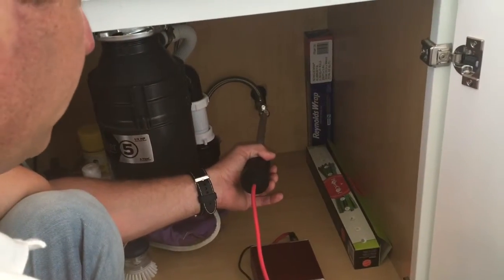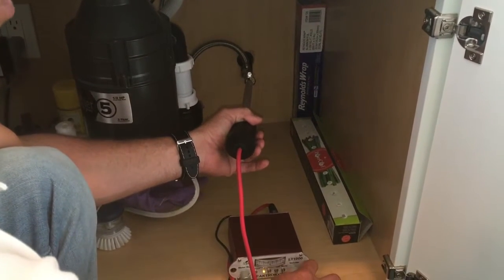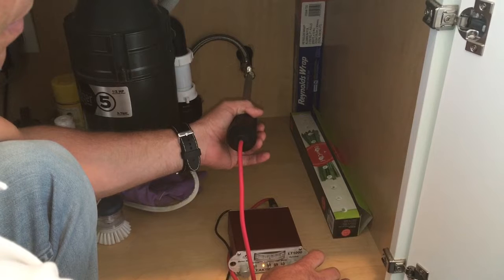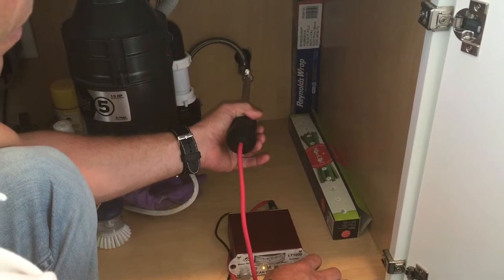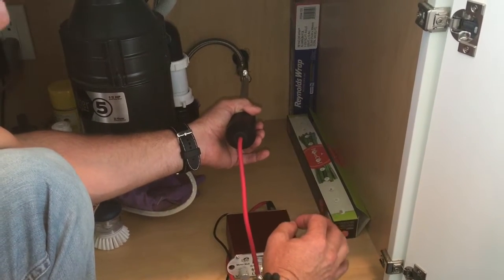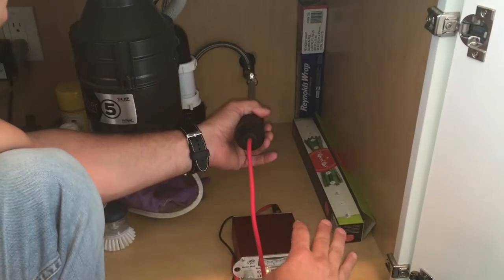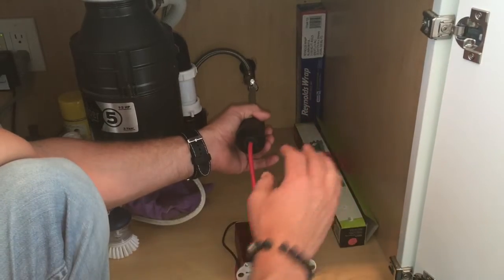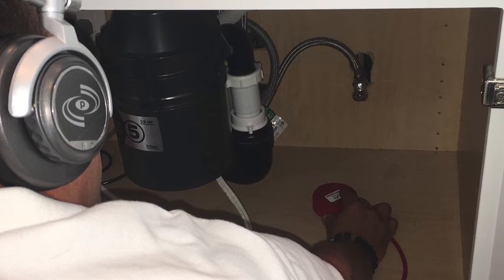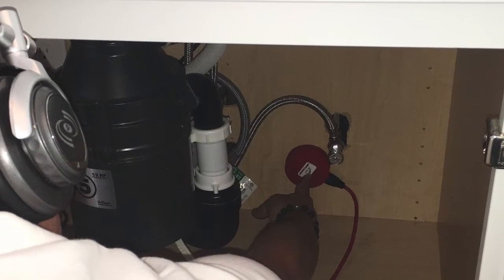We found the leak — we're hearing it on the cold side of our system. We're going to introduce the actual sound of the leak underground. We can also use our soft-sided mic to listen to all the other areas without scratching any cabinetry, and we can use our deck plate to listen around the island to make sure we're not getting false positives. Using the soft-sided mic we're able to hear a much fainter sound than metal to metal, but we can cover a lot of area without scratching cabinetry.